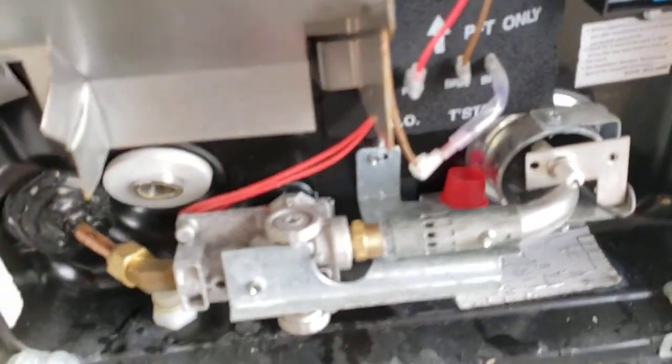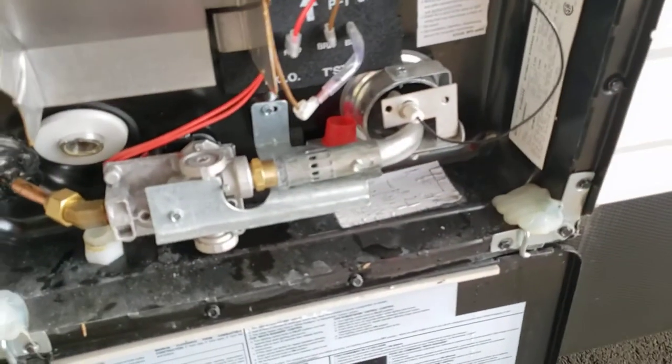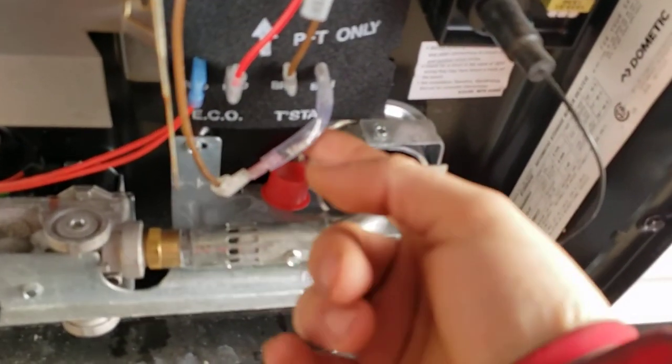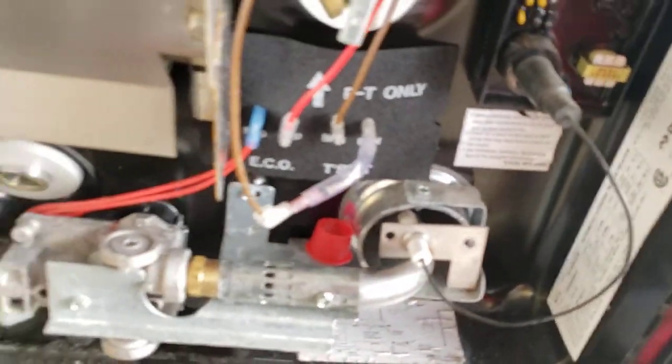Also keep it clean in the burn chamber and around the exhaust — spiderwebs, debris, stuff like that builds up in there. You want to keep it clean. If it gets real bad, you'll get soot all over the door. If it gets really bad, it'll get on the side of the camper. And if it gets really, really bad — if it flames up and the flame hits this — that's a thermal fuse and the water heater won't work anymore until that part gets replaced.